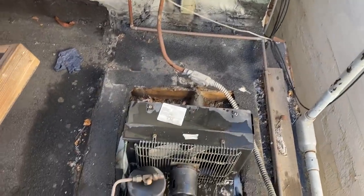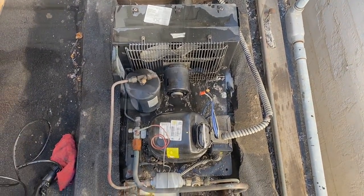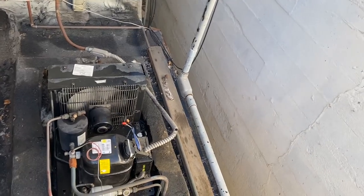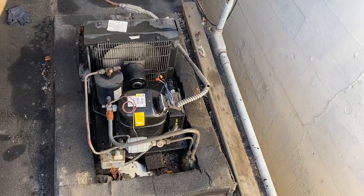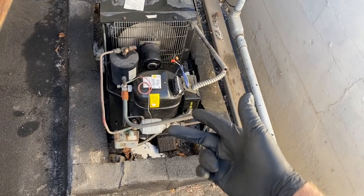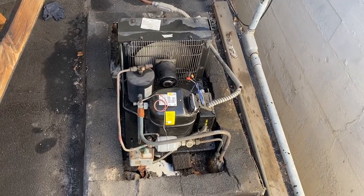Well, that's the basics. Let's see if we need to change this motor out or not. We're going to test this out here. Got the condenser washed out good. The condenser fan is starting up just fine, and the compressor is having hard starting issues. So we got to dig into the start components and check those out. There should be a start cap, a run cap, and a current relay in there. Definitely having starting issues for sure.